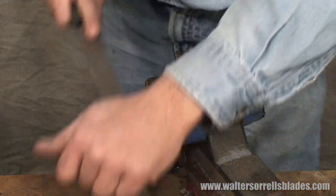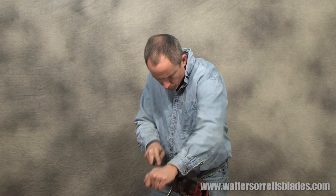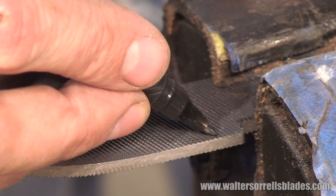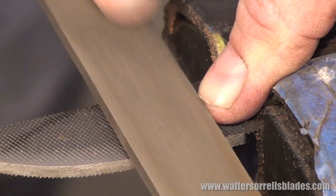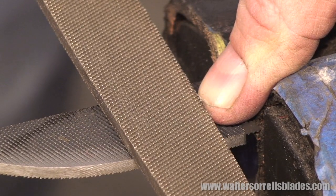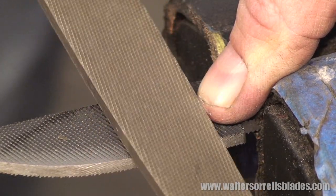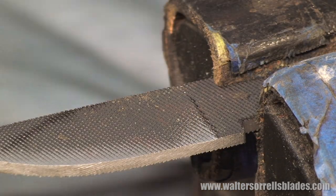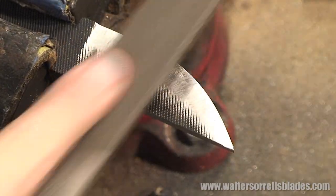Let's talk about some important principles of knife making. It's really important that the blade be symmetrical — in other words, that both sides of the blade slope exactly the same down towards the edge. If not, it'll cut badly and look even worse. Notice how the bevels work: they stop before they hit the tang. This little section where it stops is called the ricasso. It gives you a little bit of blade to grip or to index off of and makes the blade easier to sharpen. There are lots of fancy ways of doing ricasso, but here we're just going to let the file do the work and give us a nice clean square line where the ricasso and blade meet. Symmetry is king — the ricasso should be the exact same width on both sides of the blade.